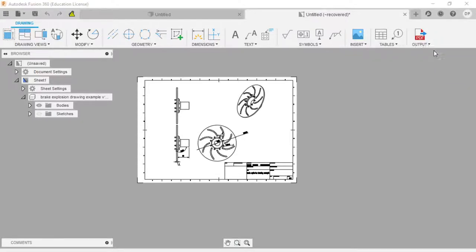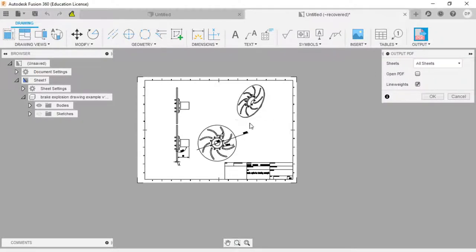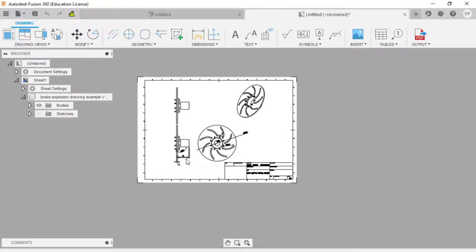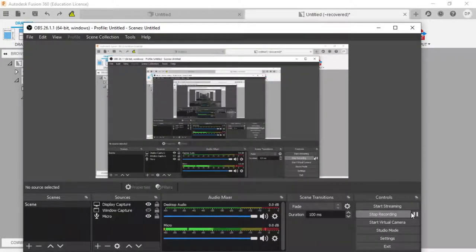Let's say we output as PDF. This is the only sheet I wanted down here. If you make multiple sheets for your drawing, so you have multiple views, for example, you can choose which sheets you want. Let's go to create, okay. I believe it's going to print somewhere. PDF, and I don't particularly want to open this because Adobe is having weird moments right now. But it's saved in a PDF. Actually, I'll pause it and then I'll get it open.